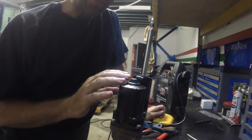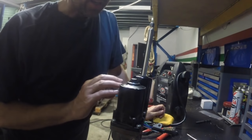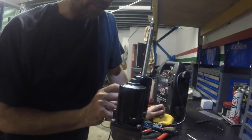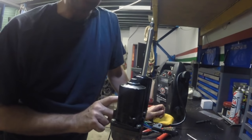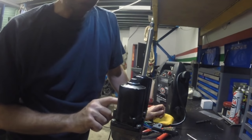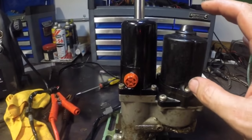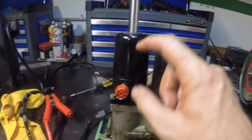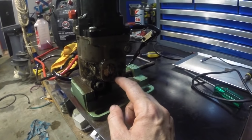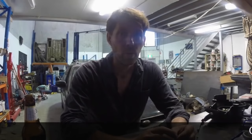It's been going up and down a few times and it seems fine. What I've been doing is leaving this filler cap cracked slightly so as it goes up and down there's a chance for the air to escape so it can bleed. When it gets to the top of its travel, this is when the bulk of the oil is inside the piston that drives the motor up, and at that stage the reservoir is at its lowest. So I took the whole fill plug out and put a bit more oil in to top it up while it was at its highest point. When it's at its highest point the oil level should be to the bottom of the fill plug. So it's all pretty much ready to go back on the boat now, with the new cap, the new oil seal around the shaft, and the new o-ring on the bypass screw. Hopefully as well as having new oil it won't get water in it anymore.